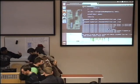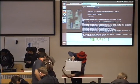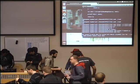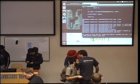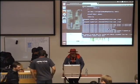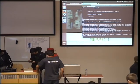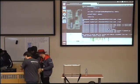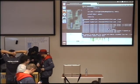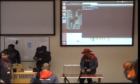I didn't understand the meaning of your demo. Why, like 01239? How is it related to this LDR thing? There is no connection. It was just how to show that you can extend those pins using external chip. So it's not related together. Okay, I got confused because of that. So you actually had to write some program here to read the data of this. Yes. And then pass it on to your GPIO pin. Yes. And then process it in the program on your Raspberry Pi. Yeah. So it's like two processors connected. Two processors connected. Okay, thank you.